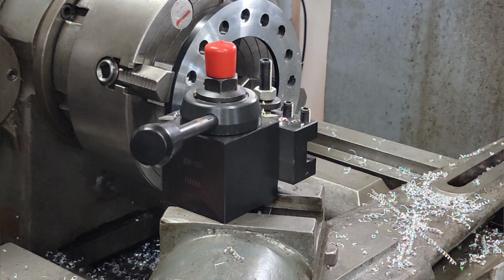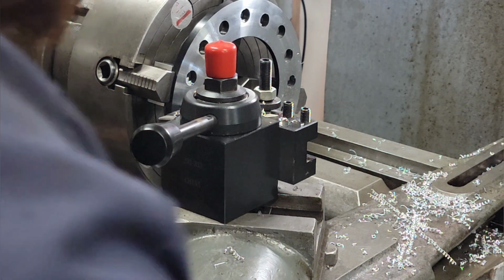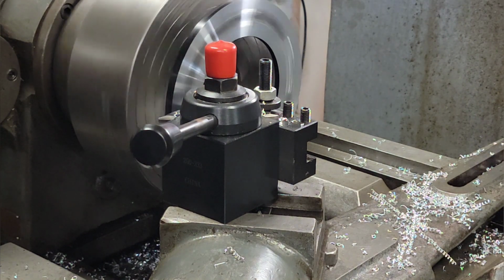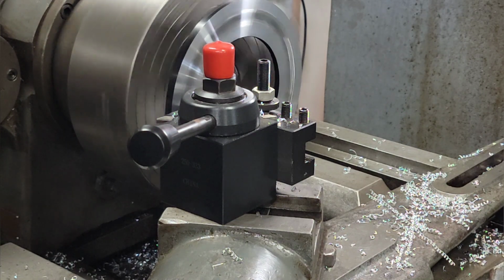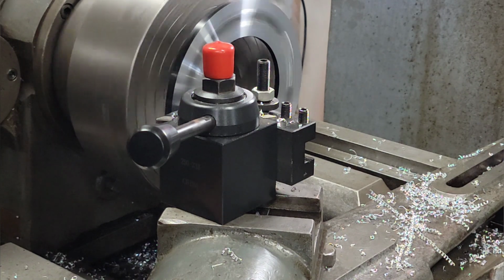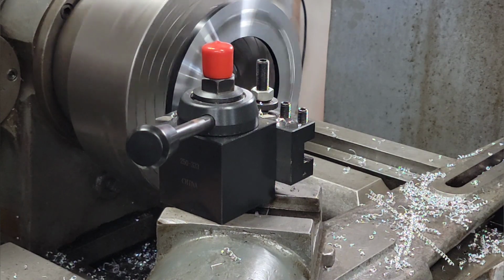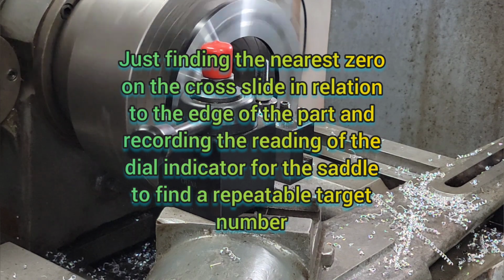We're gonna make a chamfer on here. I think we'll just make it the same on either side. It's only on there for ease of installation, so. Set him at zero. It's a good spot here. Just bring that in. Nice and easy. Zero it off.